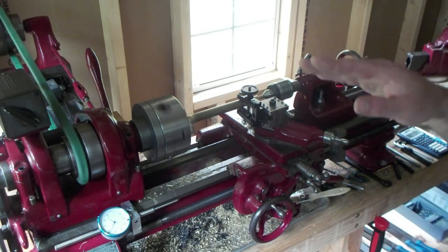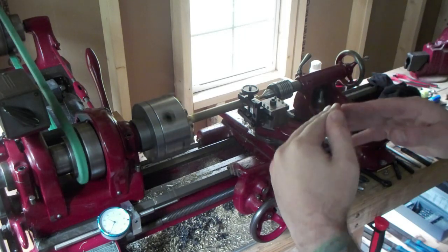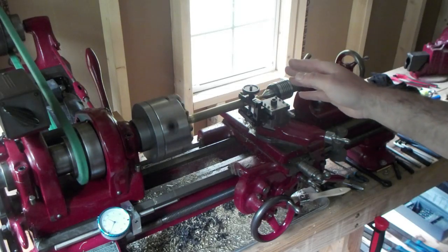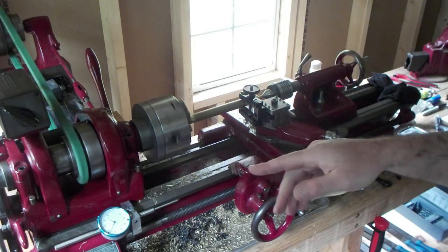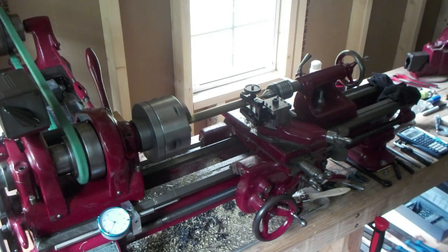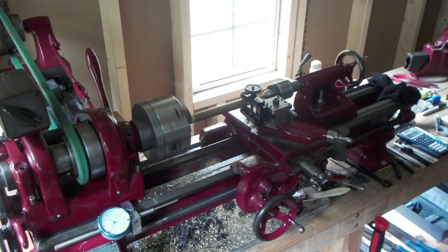Basically, where the taper and the bulk of the handle meet, when the cylinder on the knurling tool is about halfway onto that transition is when you want to turn off the machine, and then we'll unscrew. Don't try to back off while it's running, or you'll end up smudging it. Turn the machine off, let it stop, and then you can release it, and you should have a nice, good finish at the end of it.